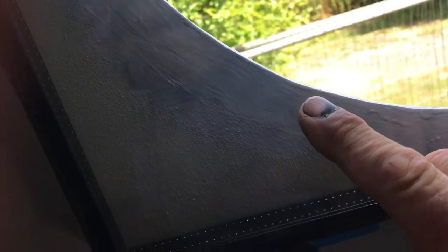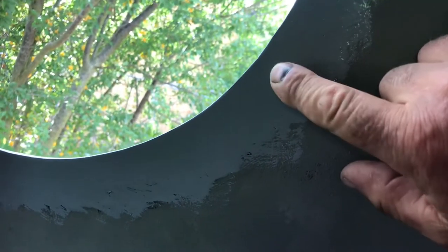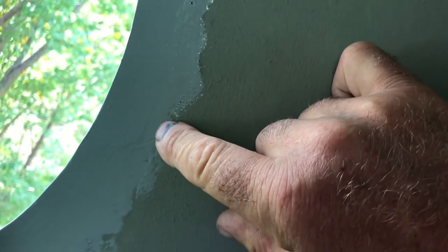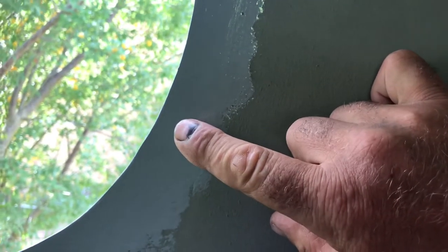The interface has to be clean when you put it on. I've opted for a two-pack primer on the outside of the boat and extended that around to the inside as well. This is really important because the butyl won't bond terribly well to conventional zinc-based paints. This is an epoxy resin, so it glues and bonds really well. When you fit the window you need to get it right, because you're never going to get it out again without cutting through the seal — it's quite difficult.